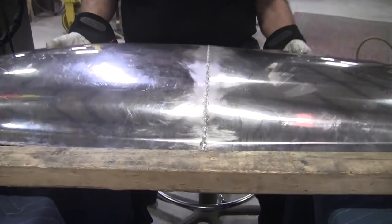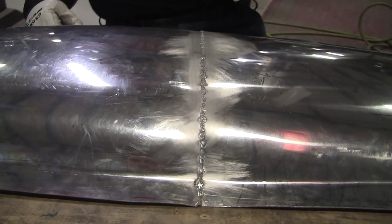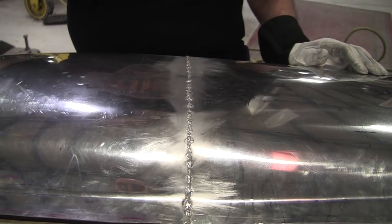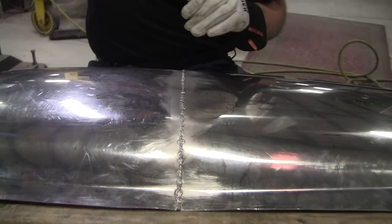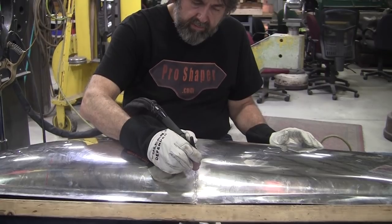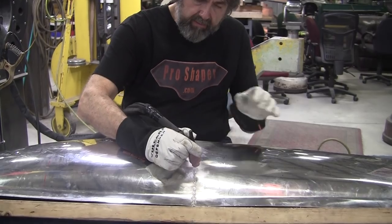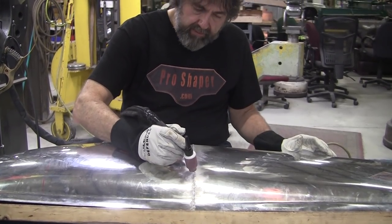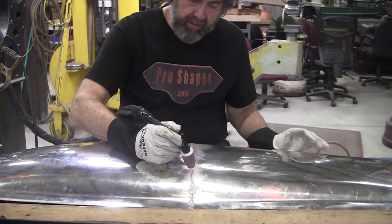That is our top weld, which is our drop through, and we're not going to do it now. I don't know if we'll do it in the next video. I'm not sure. But what will happen here is that'll all get melted right in. In the process of melting it in, we'll be doing these little circles. Joey Allen improvised that little technique here a couple weeks ago at the class, and what that does is it brings the heat into both sides of the panel.